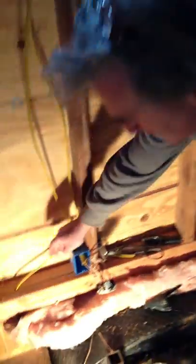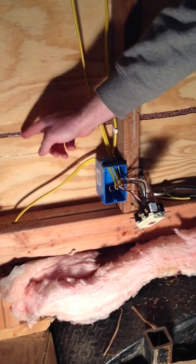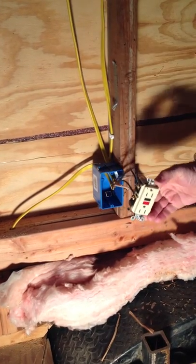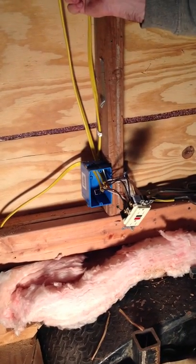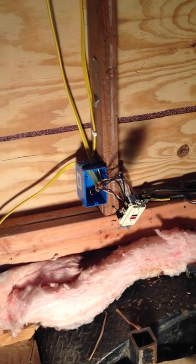Down here, I want to show you what we're doing. This wire right here is going down to the outside, and we're going to put a male plug in there, so any old extension cord can bring wire up here. We don't have any hot in here now, so what we're doing is we're wiring a GFI, or ground fault interrupter. So if downstream, over here, we got any problems, it'll trip this thing and no one will get juiced. That's how you wire a safe sauna.